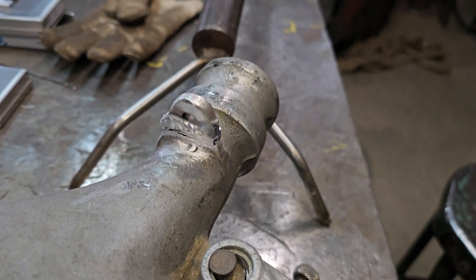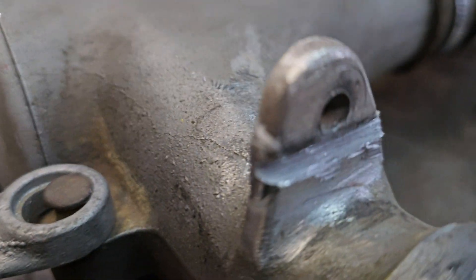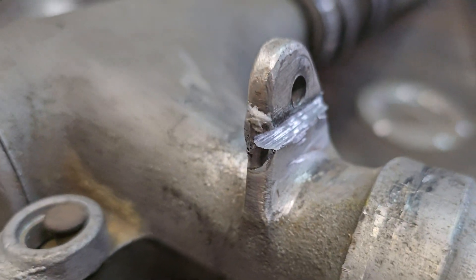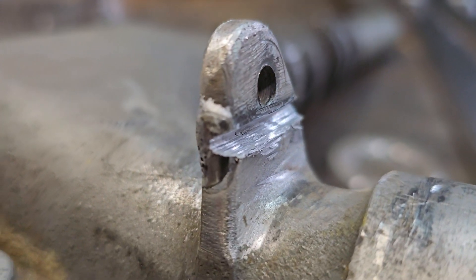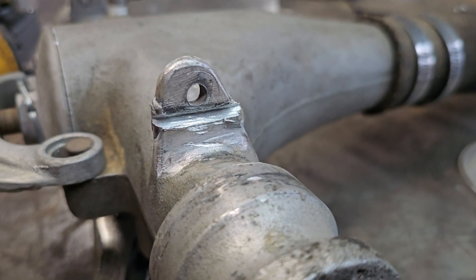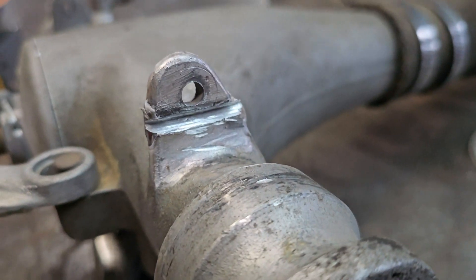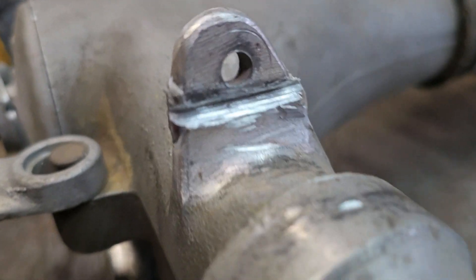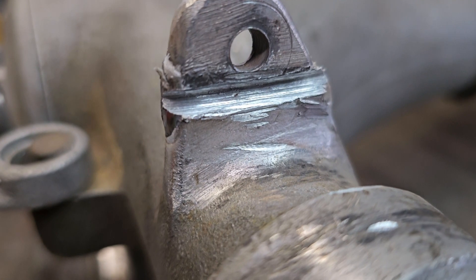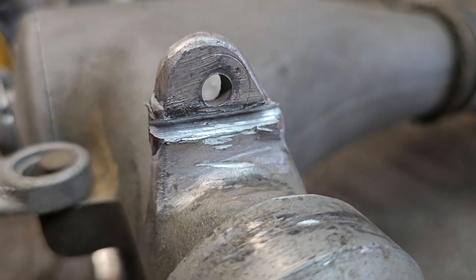I've got this one side welded up. I've got probably about 20% to 30% penetration on there, and I've gone ahead and ground out the other side here. You can see I'm well over 50%, maybe even 75% through that thickness of the metal. Now I can see a small little divot right below the hole, so I'm going to continue grinding until I don't see that, and then I will bring you back and show you the finished weld.